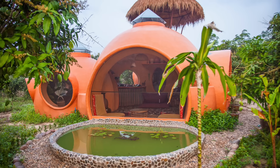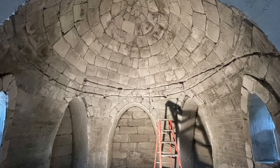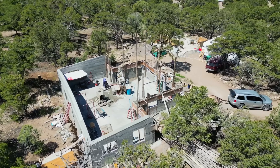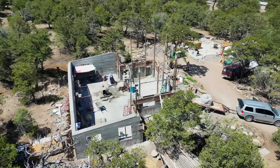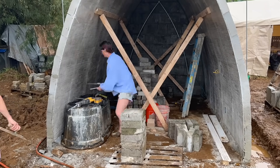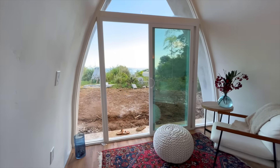We found aircrete is perfect for making dome and arch buildings, where the shape of the dome shell itself is load-bearing. But many people are also using aircrete in straight-wall buildings, adding concrete pillars here and there for strength, or framing traditionally and using aircrete as infill. Aircrete doesn't have near the strength that concrete has, but it still has quite a lot of strength, and it also provides insulation value.